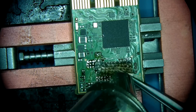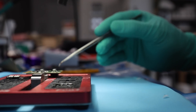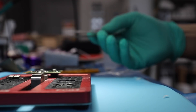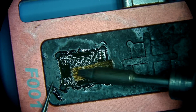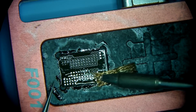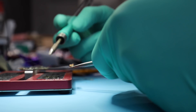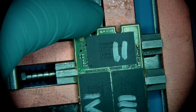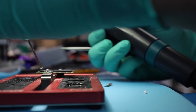It would be really nice to have an exact same card and just swap them all over, but if we look in the center, all pads are in place and that's a really good start. I also don't want to apply any pressure to this board — that's why it's kind of loose like this in the jig — because it's a really thin board and I really don't want to harm it by over-tightening the jig and warping the board.